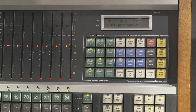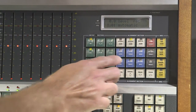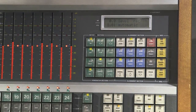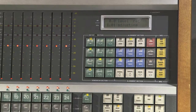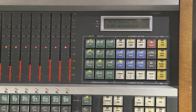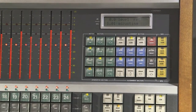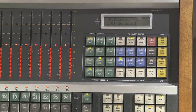After the bias is completed, we can move on to the record level and record treble adjustments. I press record level on the keypad and go into record level adjustment. It records a 1 kHz tone — hit store start and watch the show. That's done. Let's move on to the record treble adjustment.